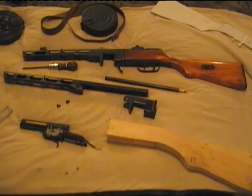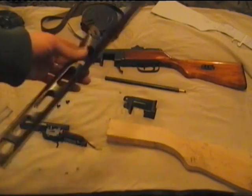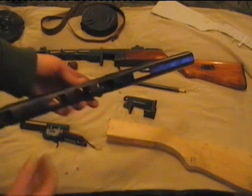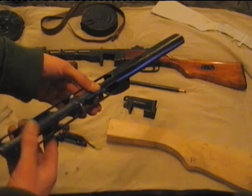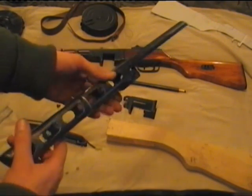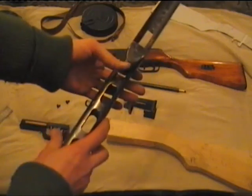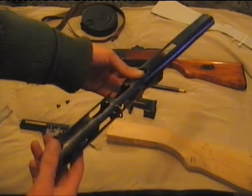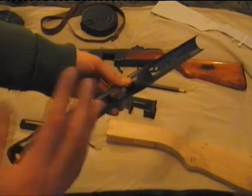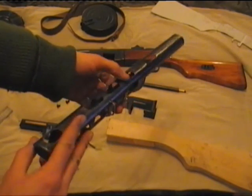I've been doing a little bit more work out in the garage the past couple of days, and today I thought it's about time to put a little bit of bluing on it. For people who don't know how I blue these things, it's basically what some people call oil dunking - you use old engine oil and a blowtorch, heat it all up and dunk the whole piece of metal into an oil bath. Old engine oil is what I use, drained out of the car over a few years of oil changes.